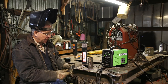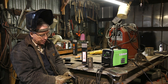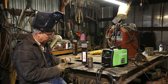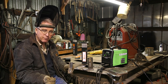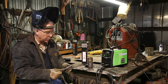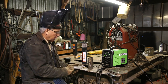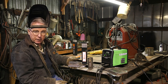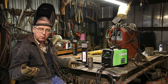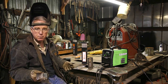My analysis of that: with 1/8" 7018 set at 155 amps, I ran about a four-inch bead with 100% penetration through a quarter-inch plate — and it didn't shut off. I even pushed it to max 225 amps with 1/8" 7018, spattering arc everywhere, wild arc, very hot — and it just kept running for three and a half inches. I also stacked beads with 7018 down around 70 amps and it never did shut off. The duty cycle is short, but for a beginner or for light duty it's certainly adequate. I think it's reasonable for what it claims.